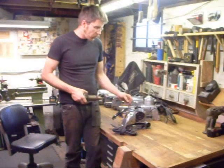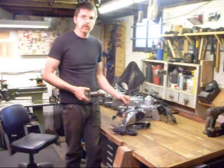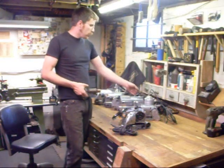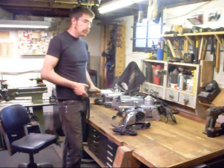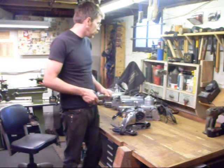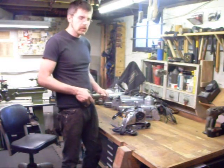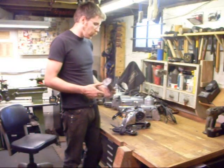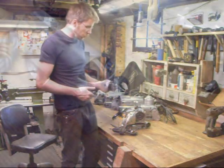For the 504 and A3 series, this armature is still available. For an older one like the B5 here, the armature was rewound, which is actually not that expensive — it cost about $125 to have the armature and field redone. It does provide a way to repair a tool that otherwise would not be viable to fix.